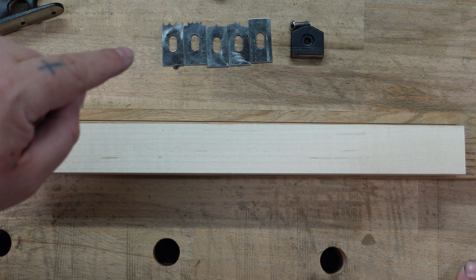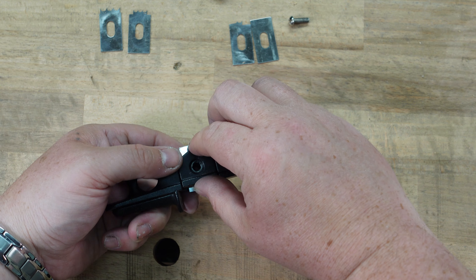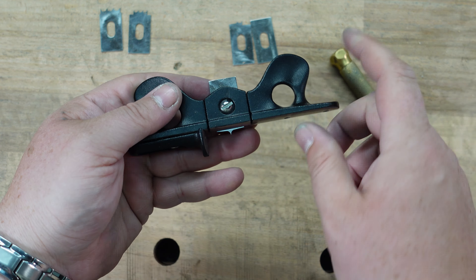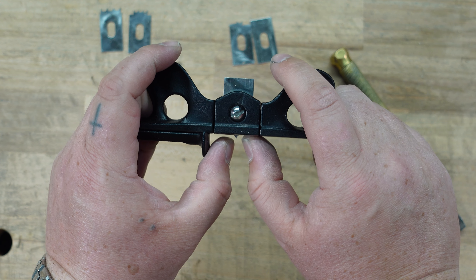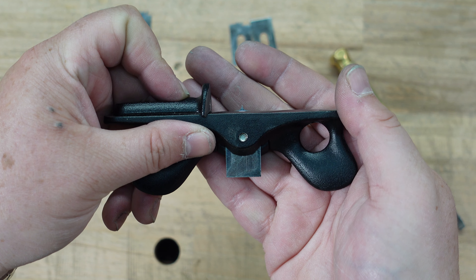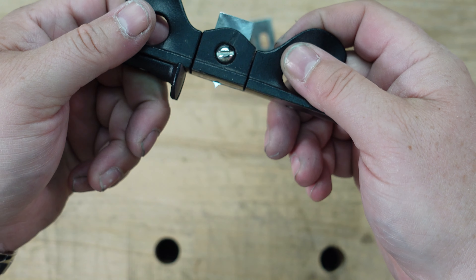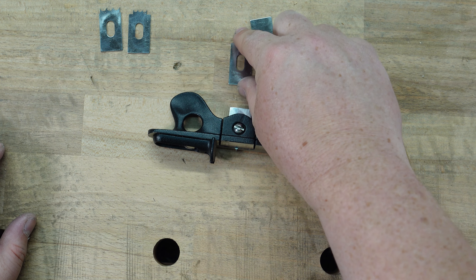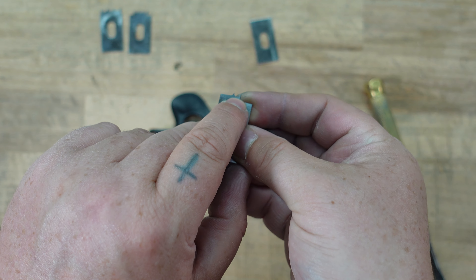So that's the board we're going to use. Let's start with a V-groove — I'm going to show you that first and then move into the other ones. When you put the iron in here first, make sure it's snug but that you can still move the cutter around. You're going to want to make sure it's not sticking too far out of the bottom of the plane, or not too far into it.